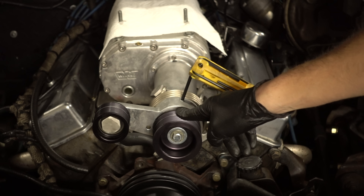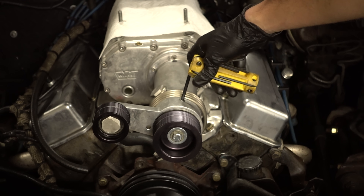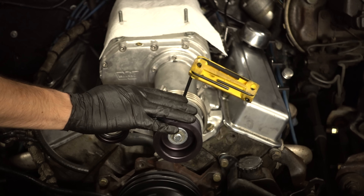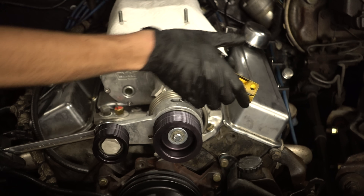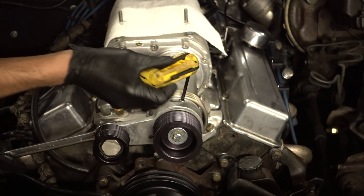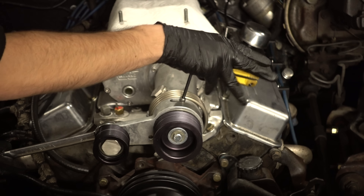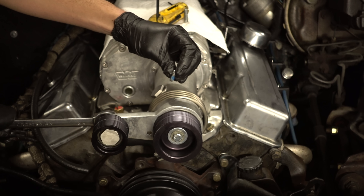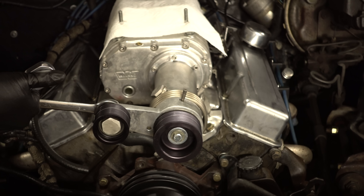After tightening this, I was checking things over and realized this bolt looked like it wasn't all the way in. And I'm glad I checked it, because indeed it is loose. When you get stuff used, it seems like you can never rely that everything is the way it should be, because this is completely loose and I'm very glad I checked it. I'm going to take this all the way out and reinstall it with Loctite. This appears to be quarter-inch thread, so we'll tighten it to 96 inch-pounds.